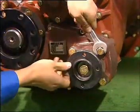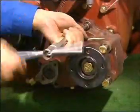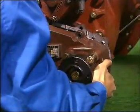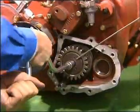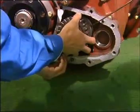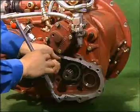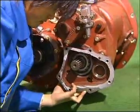Release the two long bolts in the PTO back cover and five inside hex bolts around it. Dismantle the PTO back cover sub-assembly. Release the fine tooth bolts and pressure bolts, then take out the drive gear, hollow shaft, sliding sleeve, and yoke. Release the four inside hex bolts and remove the PTO front housing.